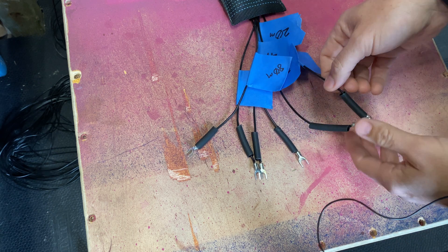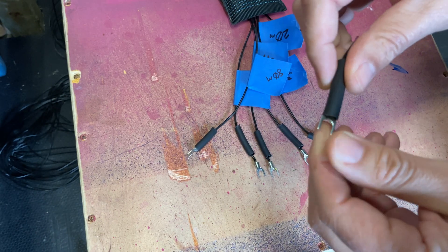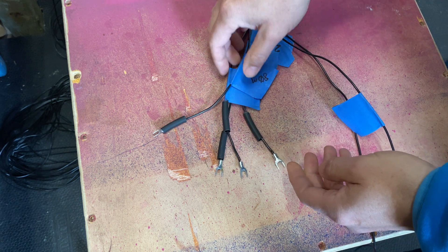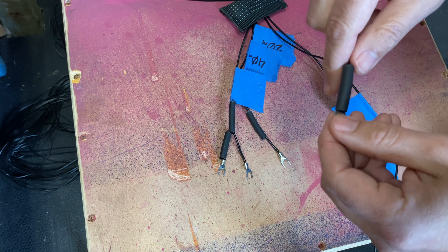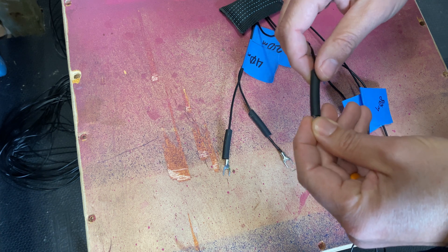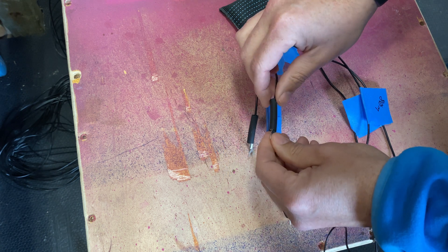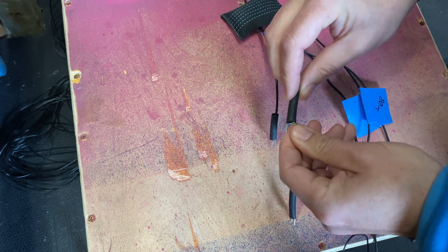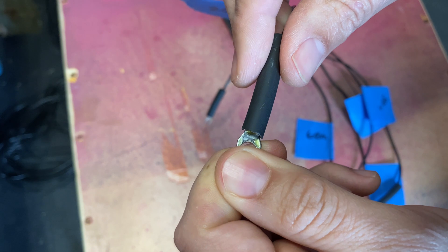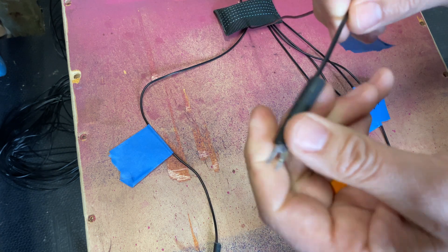I have all my elements cut with fork terminals put on them and soldered. Now I'm going to prep the heat shrink — let's call it the first layer of heat shrink. I'm getting it all butted up against the fork, a little bit past it because it's going to shrink once you get some heat on it. Since I don't want that join to be exposed, I'm going a little bit beyond, so when it shrinks it ends up where I want it to be.